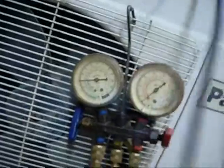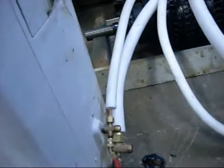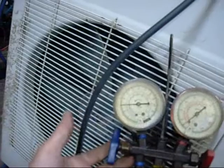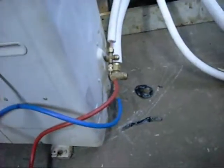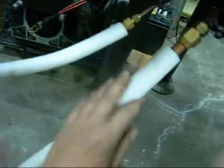The lines and everything are done. I've got the unit mounted on the test table — it's just sort of hanging there. I'm just going to finish off the electrics. It's holding 20 pounds of R22 pressure. The valves on the condensing unit are still shut; I've just charged it with 20 pounds. I'll release 20 pounds from the condensing unit and then shut it and let it sit to see if it leaks down. This is after a vacuum test — it did pass the vacuum test, but I always do a pressure test as well. Things behave differently under pressure or vacuum. The lines are all good — these are brand new line sets, and the lines coming out of the unit look very good.